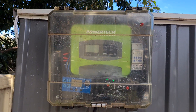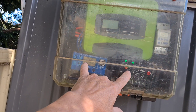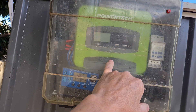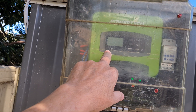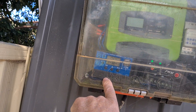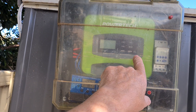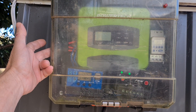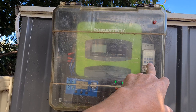Just to make it more safe, I'll put some switches in here — there'll be five switches. The two panels will each have one on each side. I'll have two switches here, two switches here and one in the center. The switch layout will have a solar switch, a battery switch for each panel, and then a load switch in the center so I can switch the load off centrally. The timer will be inside the board as well.